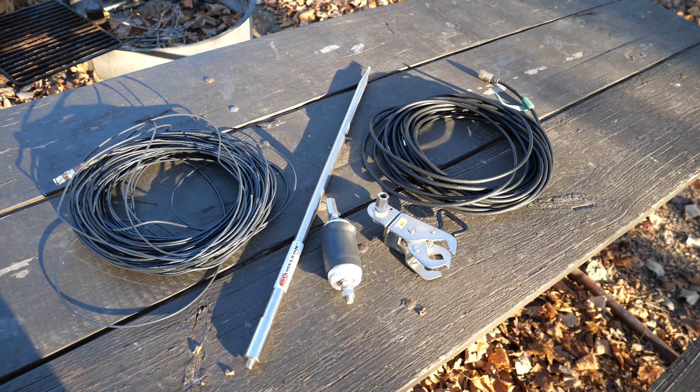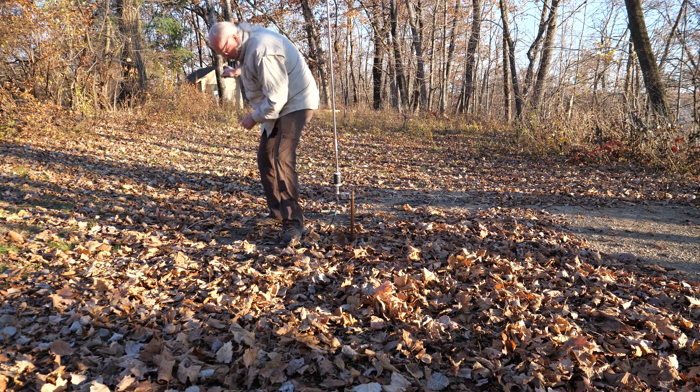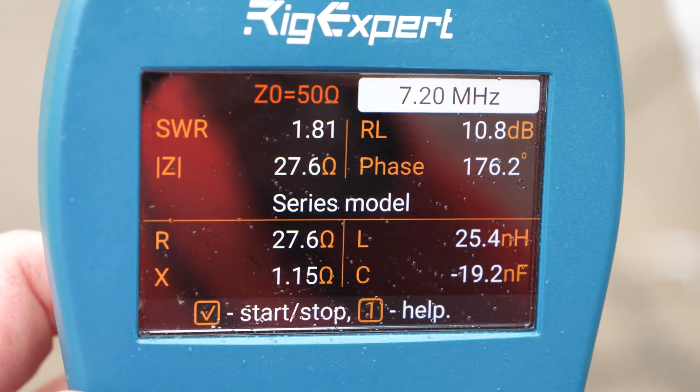Another performance aspect I found with the coil is that your cable length and ground network can make a difference. With the Silver Bullet 1000, I've been using eight 16-foot ground radials with great results on the 40-meter band and on the higher bands. When I use this setup with the Sporty 40 — 50 feet of RG-8X coax and eight 16-foot radials — my SWR does not get much below 2-to-1. On investigating with my antenna analyzer, I'm finding the impedance drops down to about 24 ohms and the reactance is almost eliminated. While my SWR is high, my antenna is almost entirely resonant on the 40-meter band, and that SWR issue really doesn't affect my ability to make contacts.